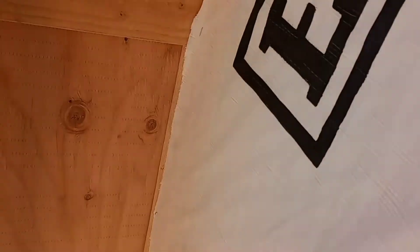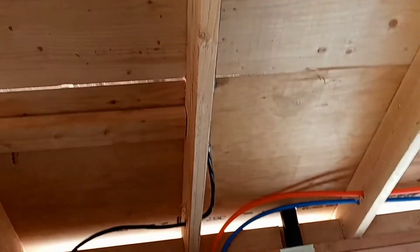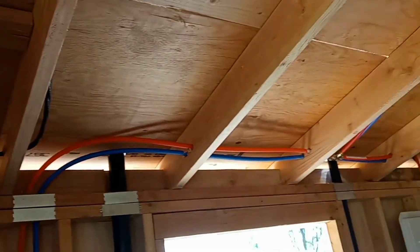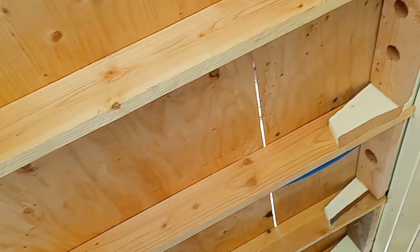The blocking is coming off through a notch in the outside rafter equal to framing and it's tied into a rafter and a second rafter over. We'll go up in the attic and I'll show you how we put those rafters through from the addition rafters and tied into the existing top plate. Up here in the attic you can see where the rafter tail is coming in sitting on the sill plate.